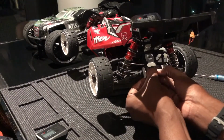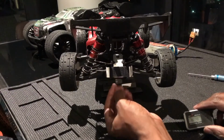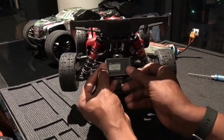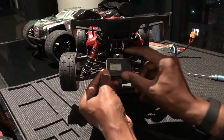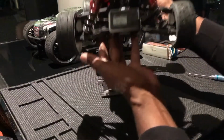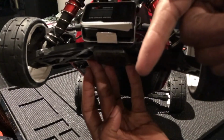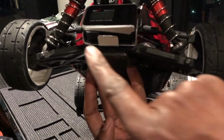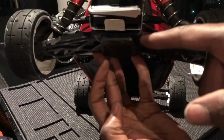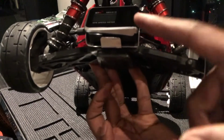It's just something, because there's a bottom plate as well as this plate at the bottom to hold it. I know that it's going to hold pretty well. If I gently put this in, just so that you can see without moving too much, as you can see there, we've created a bracket underneath that will stop it from falling down that way, and we've folded this aluminium so that it won't move side to side. If you really want to be careful, you can get some zip ties and zip tie around the speed controller. But I've added some Velcro on both sides just to make sure.